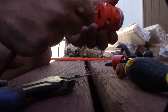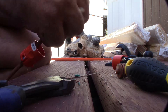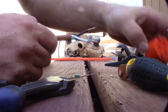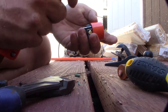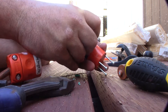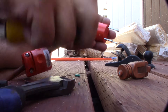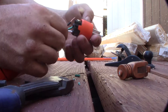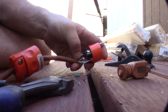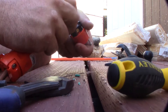These are all stripped and twisted. I should have done that before I put these through here. Put that through there, make sure these are nice and tight — sorry, my hand's in the way. The camera's at a weird angle. Just remember, the neutral is the white wire on the wider prong. The small one is the hot. The ground is obviously the green.